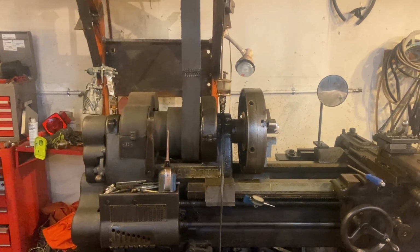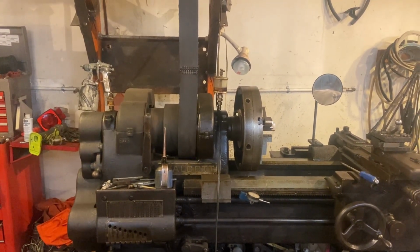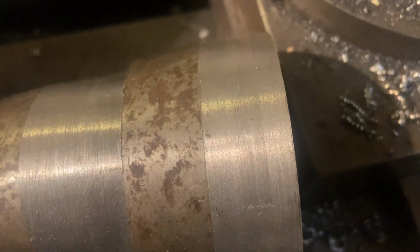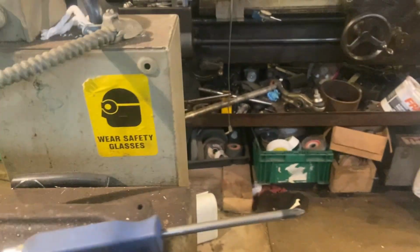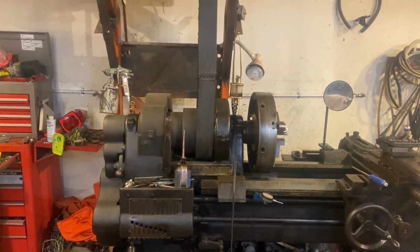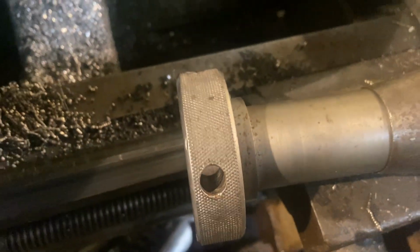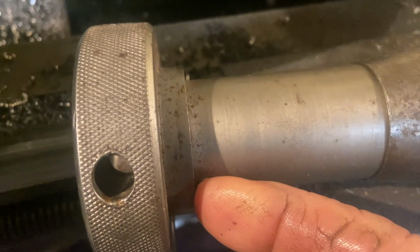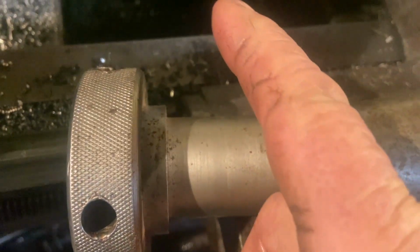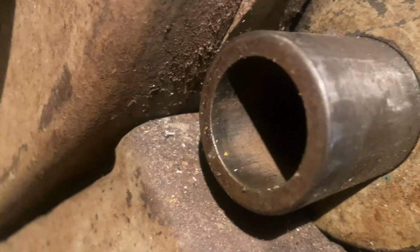The length on that lathe right there, from the jaw chuck front to the back, is 34 inches. Now if I add, I don't know, 1/4 inch onto this face for a stop, so I can put it further back in, I can use probably about a 30 inch, 1 inch bar. And then I will have this piece sticking out the tail of that lathe. I'll have to make a bushing because that one's got a 1 9/16 pass through, and this one's only 1 inch. So I'll have to make a bushing for a bearing face. I won't need one of them for here because it'll butt right up against the end here.